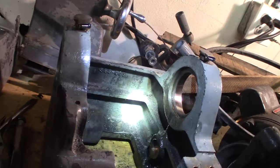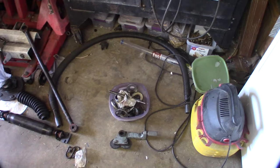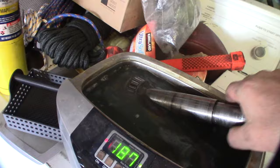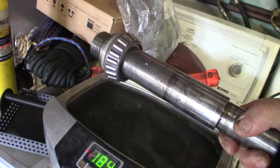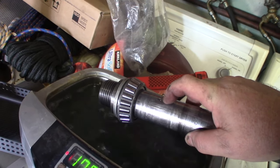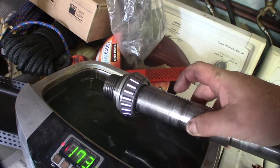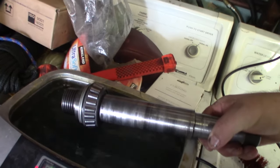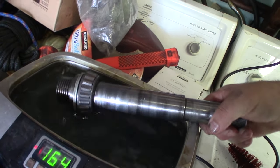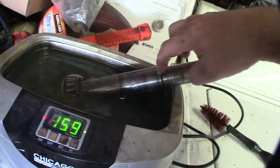I was getting so much metal - when I was pulling this stuff off I was getting tons of metal shards on my fingers. The big parts I'm degreasing outside, but the shaft I'm just cleaning off the oil so you can see all the damage. That big divot is where the set screw was, and that's why I couldn't get that gear off - it put a huge mark on the gear too. I'm going to file this off and run some emery cloth on it to polish it up. Looks like it ran hot - wasn't getting lubrication. That's the back gear, that's what the back gear rides on.